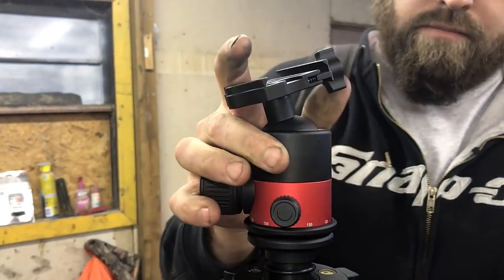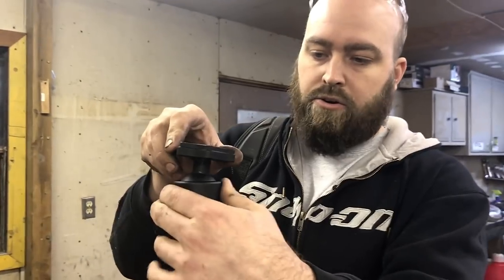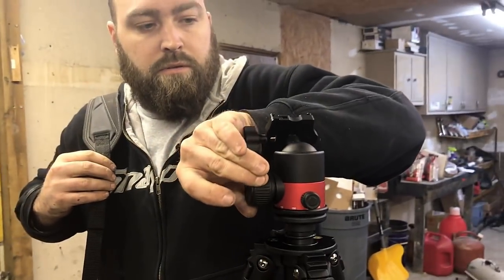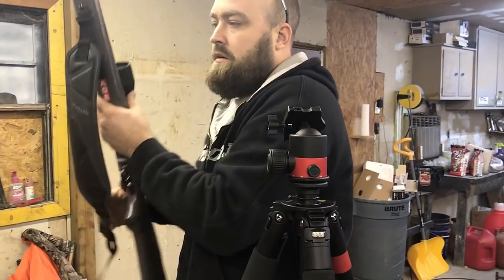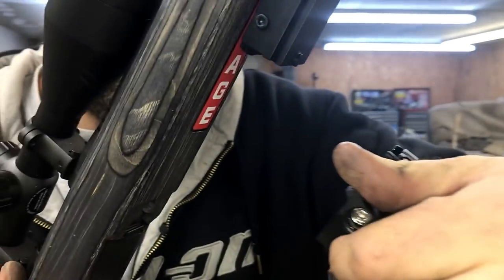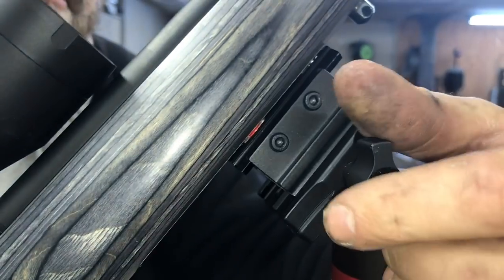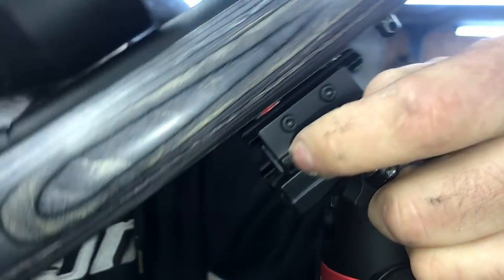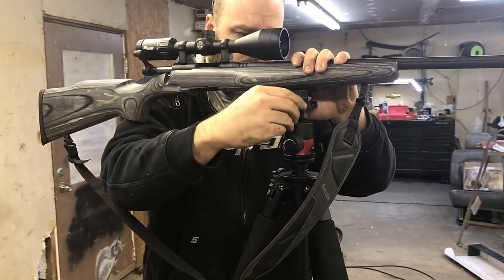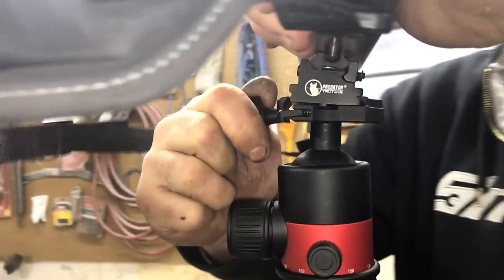What we're going to do: it's got a groove here, I'm going to line it up, tip it back and go ahead and set the brake up a little bit. You've got to make sure you get this all the way back down — it does have a stop on this point. Lock it in one side and it'll kind of set itself in there. Once you do it a few times you'll get better. Once you raise it up, check and make sure you're nice and square on everything and start snugging it up. Alright — it's all the way down, snug that up. You don't have to over-tighten it because it can't go anywhere since it's in the grooves.